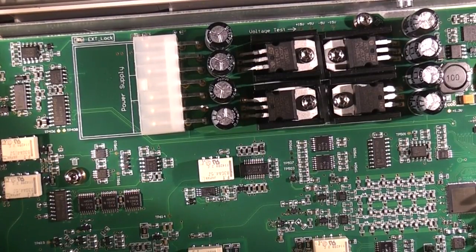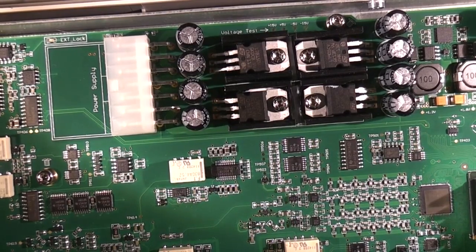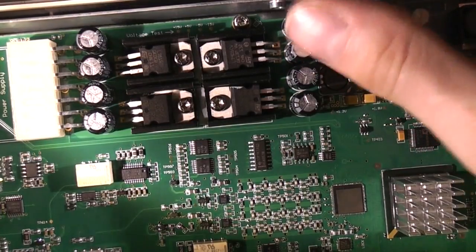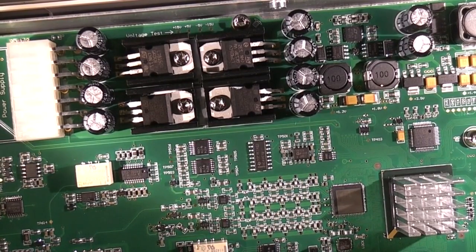Let's take a closer look at this main board, starting off at the power supply input. There's a bunch of linear regulators — these are obviously going to provide the power supply for the analog output stage. There's ±5 and ±15 volts there. One thing I've noticed on this board is all the parts are very well-known makes: Analog Devices, Linear Tech, even the capacitors — these are EPCOS. There's no weird obscure Chinese stuff that you've never heard of anywhere.